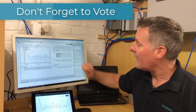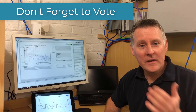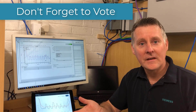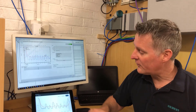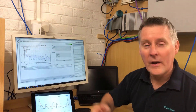They're picking up at the far wall, which is about 4.7 meters away. Over these two videos you'll understand what echo profiles are and the intelligence behind them, because a non-contact level measurement device can't see through everything. The radar can see through plastic, but it's picking up wooden beams here, so there needs to be intelligence in the device to ignore those false echoes — that's what the two red lines on the profiles are.